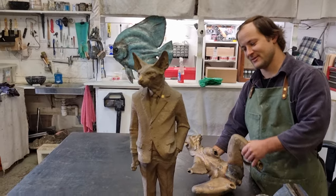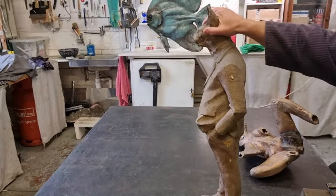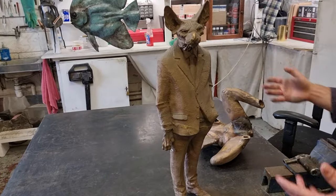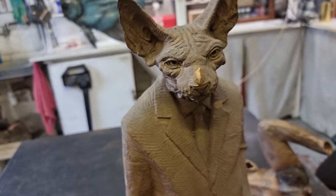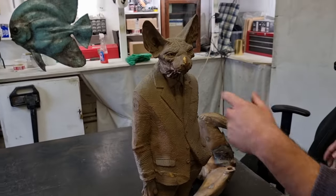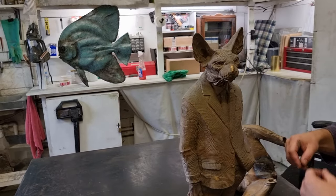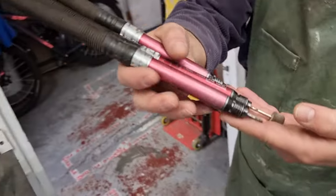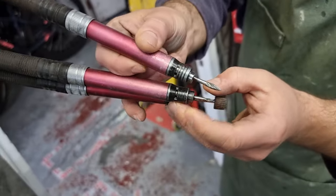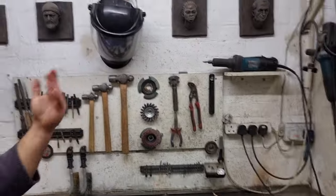This guy here is pretty cool — it's quite an old sculpture from 2018. A sphinx man. It's also unfinished; I'm working on it right now. I can see the nose has an unfinished piece on it. Those are the casting canals where the bronze pours in — they are attached at these points, and then you use hand tools, dremels, air tools, angle grinders, all sorts of things to finish it. There's a welder here too.